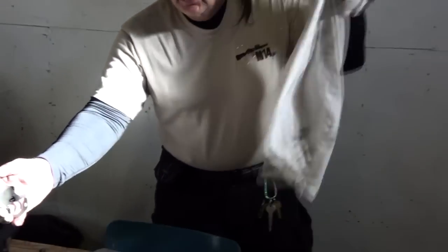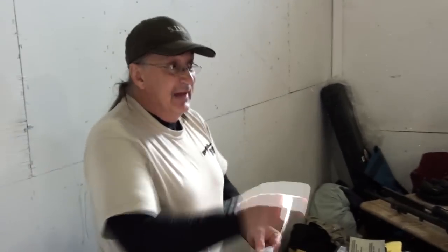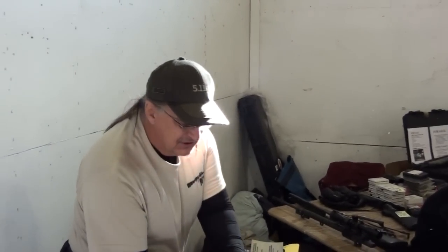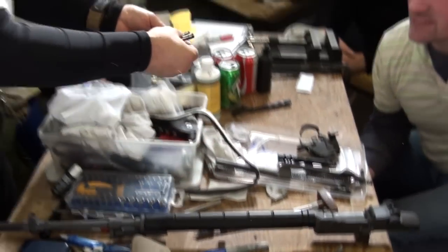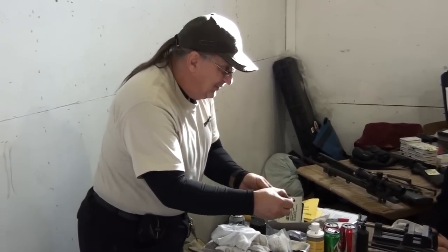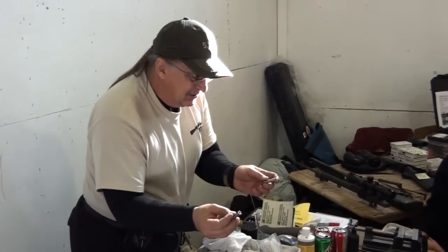This is how we diagnose some of the trigger issues. So everybody's got a fairly happy bolt. The last and most expensive part is: do I need a GI bolt? This is the headspace gauge — notice it's ground out in the back so we can run them without having to remove the bolt. If you try to check your headspace with a normal gauge that doesn't relieve for the ejector, you're pushing against about a 50 to 100 pound spring. There's no way you get an accurate reflection of your headspace with the ejector in a gun using the standard headspace gauge.